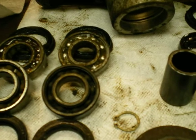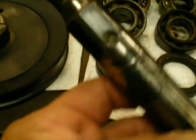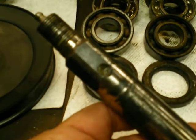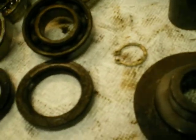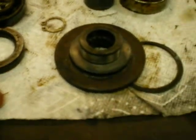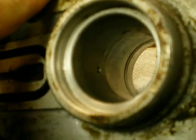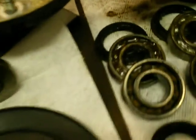And I'm finding out that there's somewhat of a design flaw here, especially on these outer shafts. The grease port that services the outer shaft bearings is way up high. It seems like the top bearings get good grease, but the bottom bearings on the shaft are actually not getting the grease they need to keep their life expectancy. Now, the center shaft — you can see there's a port, and it's pretty well centered down low, and it greases the bottom bearing quite well. I just wanted to share that with you.